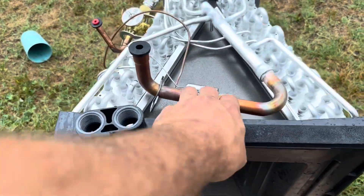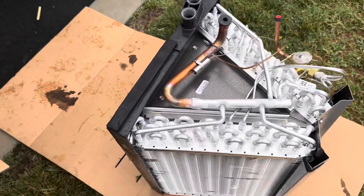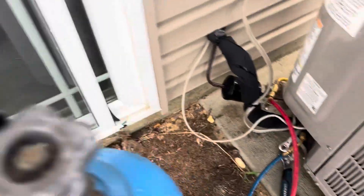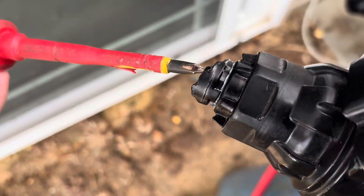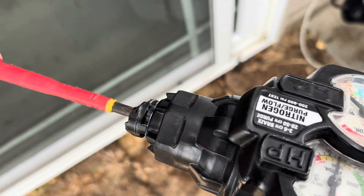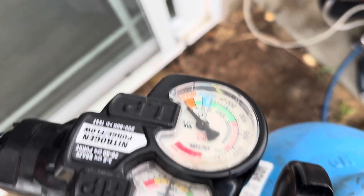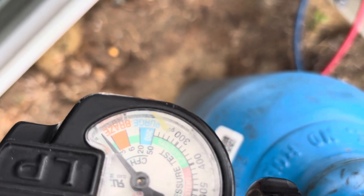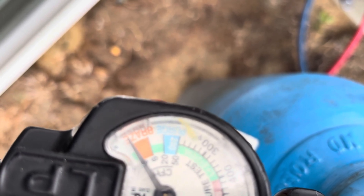Got the old pan put on the new coil. I'm just going to box up the old coil for warranty and throw it in the box. Getting our nitro set up here for brazing. My knob broke off, so I got to do it with a screwdriver — I need to get some sort of replacement knob. Let's just bring this up. Right there, should be good.